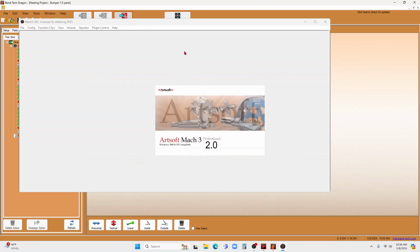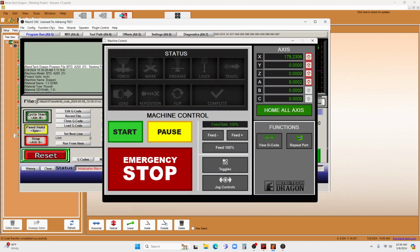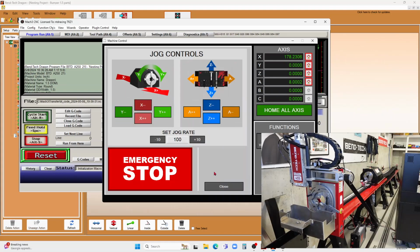We hit the Run Project button, and it opens up all these control interfaces, and we connect it to the machine. Now, if you look over here, none of the axes are home, so it doesn't really know where all the parts are on the machine. We need to do a homing operation. But before we do that, if we don't jog the trolley all the way to the back end of the machine, it will literally take forever for this thing to run a homing operation. So we're just going to manually go at fast speed towards the back. And now, when I hit home all axes, it'll go through the homing, but that thing will be closer to where it's got to home. It'll take a lot less time.